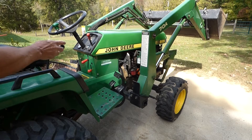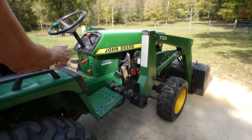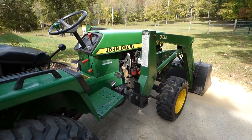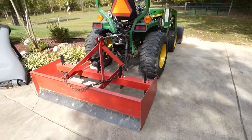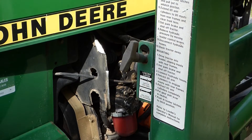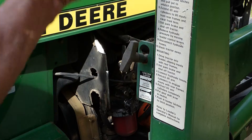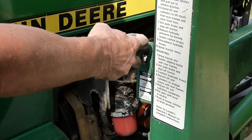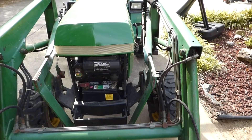Let your loader down all the way to the ground. Make sure your brake is applied and locked in place, or if you have another attachment like I do, I've got that resting on the ground to hold the tractor in place and take pressure off the hydraulics. Next, release the loader latches — it's sitting down in a pocket here. Push it in and it'll lift up into the bigger hole so you can pull it out, then lock it in place. Do the same thing on the other side.